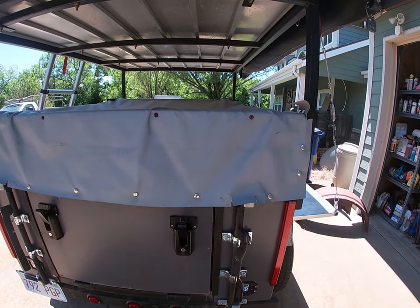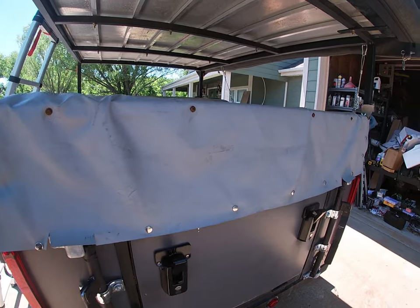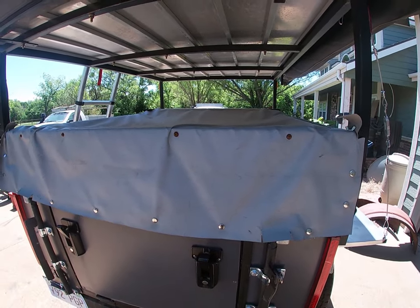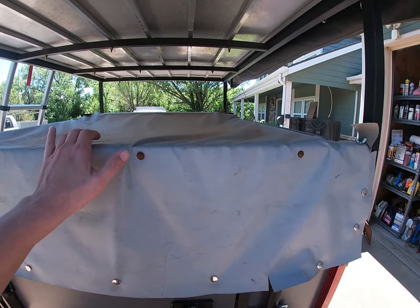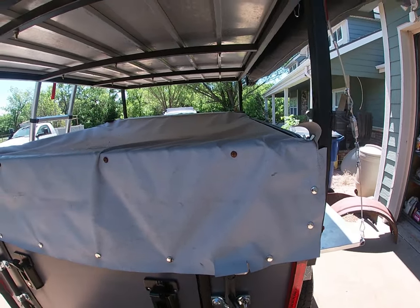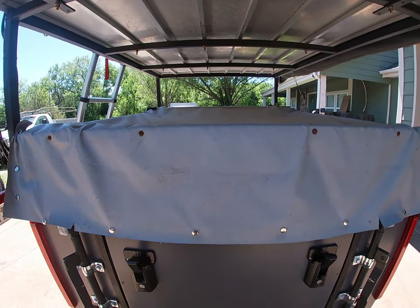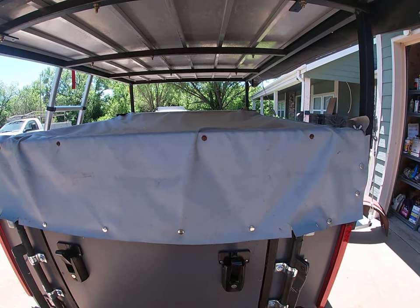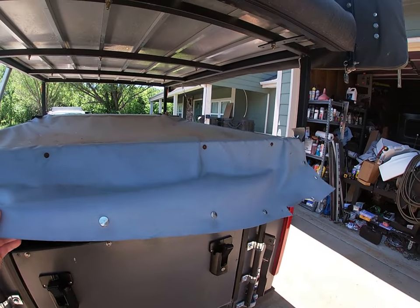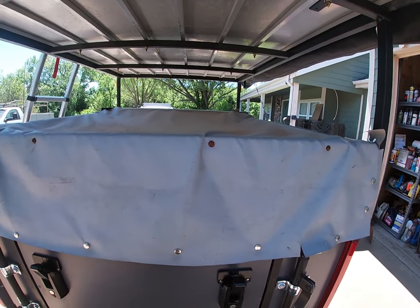Going back to the cover — still a work in progress. I didn't intend to have a soft cover but needed it finished quickly, so I used this vinyl material that I've used before on the back of trucks — it does a really good job of keeping the weather out. I've got a piece of extruded aluminum that the cover is bolted to, then tied down with wing nuts to the top of the trailer's frame. Initially without that, enough wind got through the corners, pulling it open and causing it to flap. The rear support and tie-downs keep the snaps from coming loose on the road.